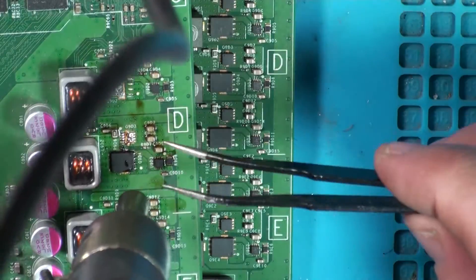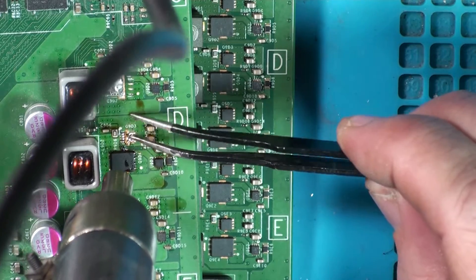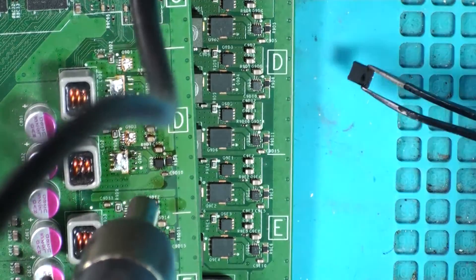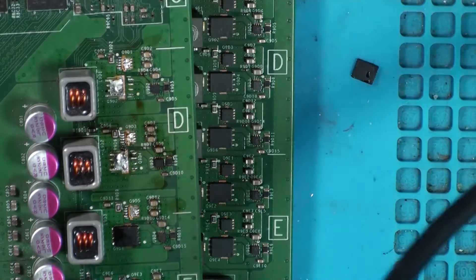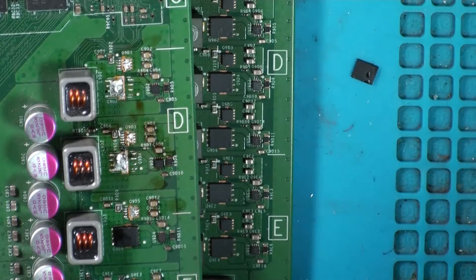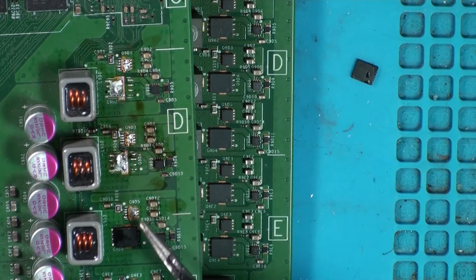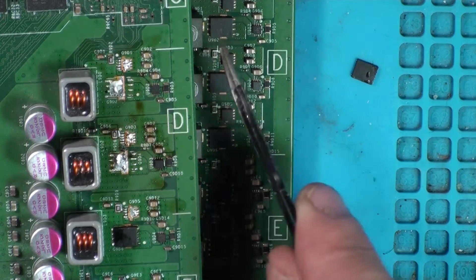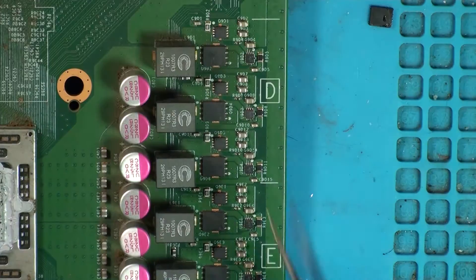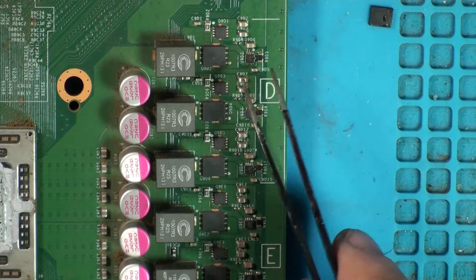Pop the temperature up to 450°C. See all the solder's moving — there we go, it's off. You don't want to pull it too hard because you can pull the traces off the board, which matters when we change this one. Now the board will be nice and warm for placing that chip back on.